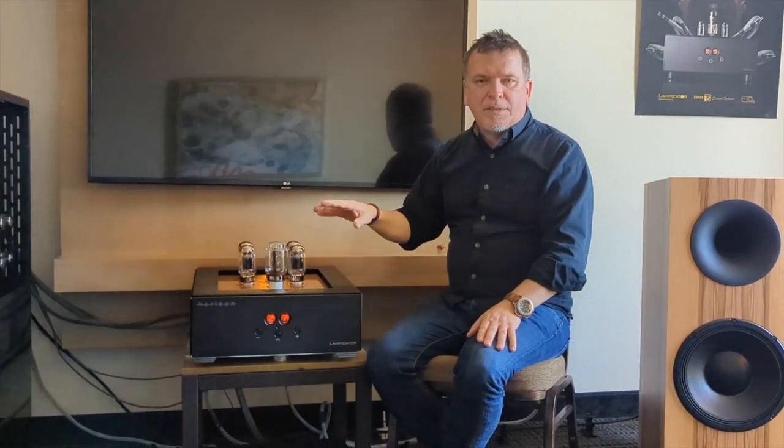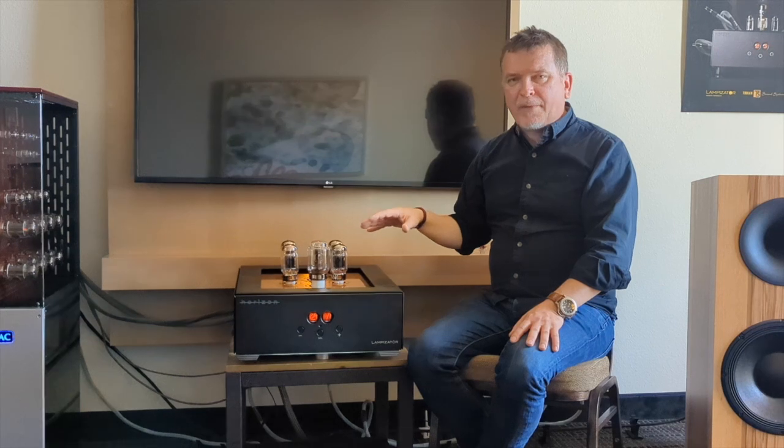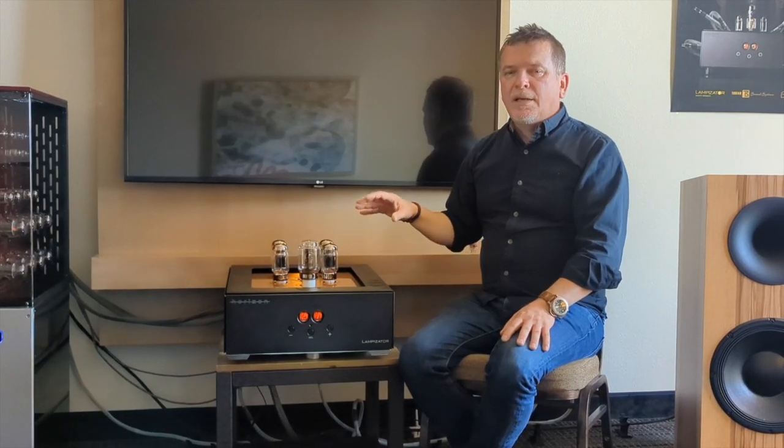3 transformers means 3 times the 100 watt core, and then the copper. We have primary windings, we have screen windings, we have also secondary windings, those that provide precisely correct voltage to the various elements of the circuit. We have 17 power supplies in total, so there are 17 separate windings to avoid crosstalk, avoid sharing the load, avoiding overload, and generally this results in a beautiful sound, very clean and very transparent.